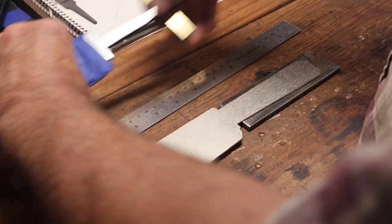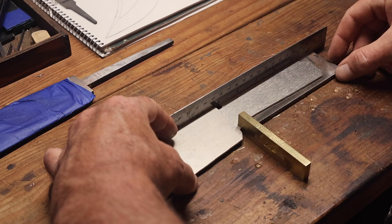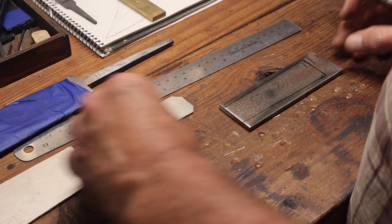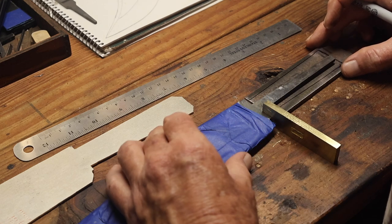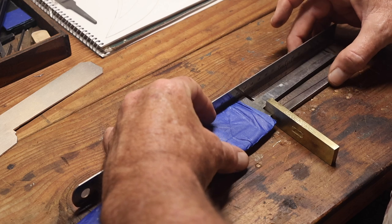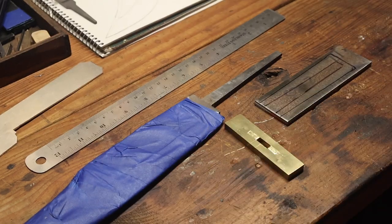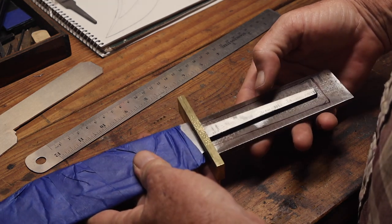At this point I've got the heat treating and final grind done on the blade, guard fit-up done, and I'm starting to work on the handle. I've got a piece of quarter-inch W2 that I'm using to make the frame. I'm laying my template over that piece and drawing out the outline of where the frame is going to be, then placing the knife on it so I can get the tang drawn on it as well, getting everything lined up and evenly spaced.